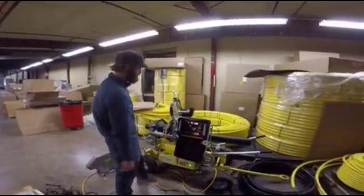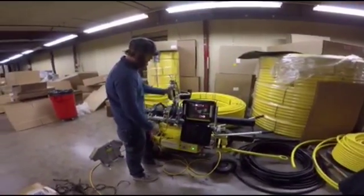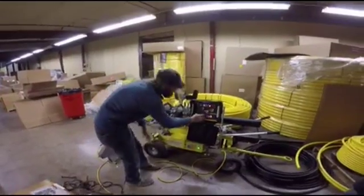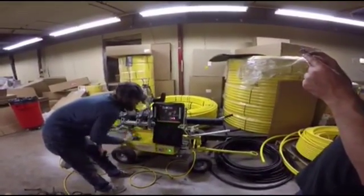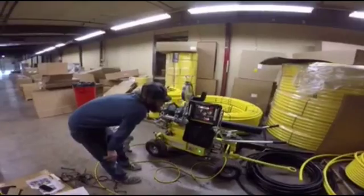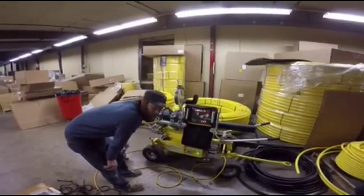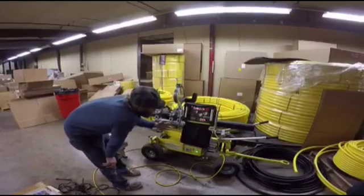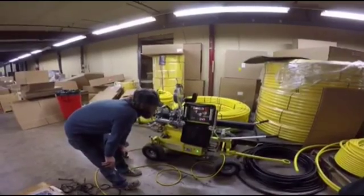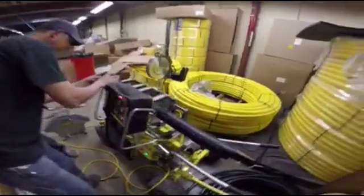Right now it's beeping with seven seconds left — it's going to open up, and I'm going to use a quick snap. The plate will sometimes pop free on its own, but if it's stuck you can snap it with your hand. You only have about 9 to 15 seconds to inspect your bead before closing the carriage — that timer starts to make sure you don't go beyond your allowed time with the heating plate removed. When it was open, I pushed the fusion button — it automatically moves on to the fusion cycle, closes the jaws, brings it up to full fusion force, and is adding that 80-some psi of drag pressure.